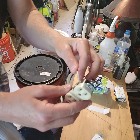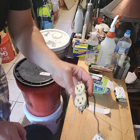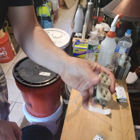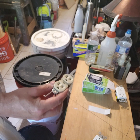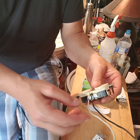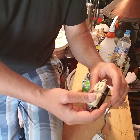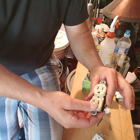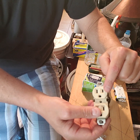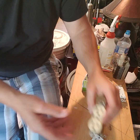That's for a basic 120-volt installation. If you have 220, it's a different system and I'm not going to get into that right now — beginners should only be working with 120 anyway. So again, black goes on the brass terminal and white goes on the silver. Another way to identify the terminals without even seeing them is to look at the slots — the smaller slot is the hot or black side, and the larger slot is the neutral or silver side.